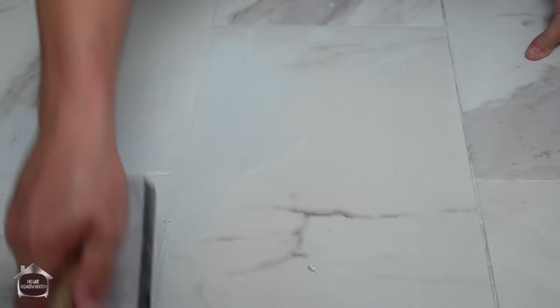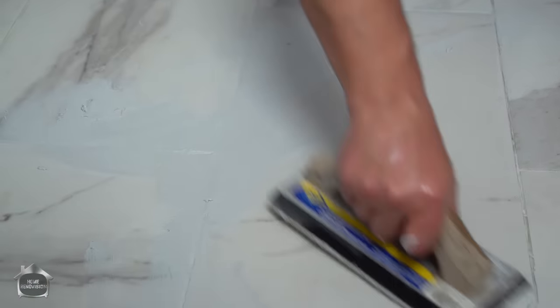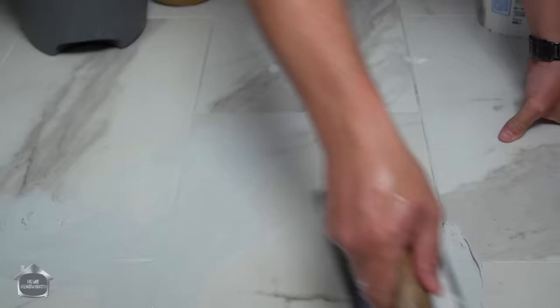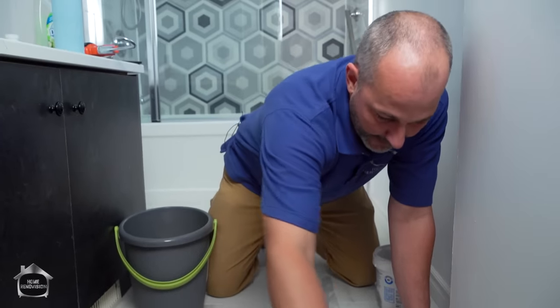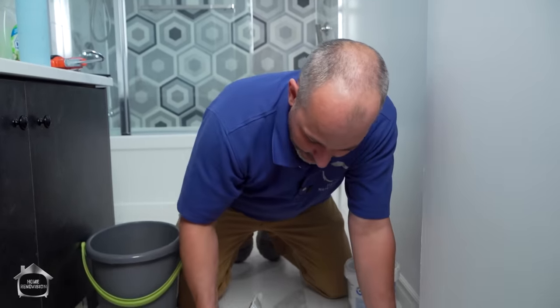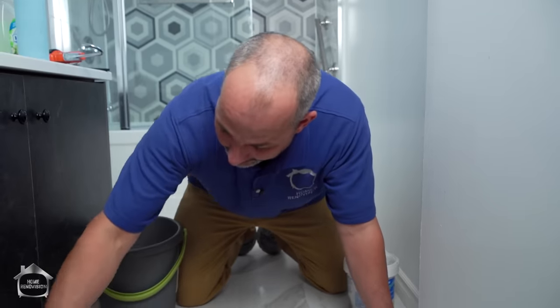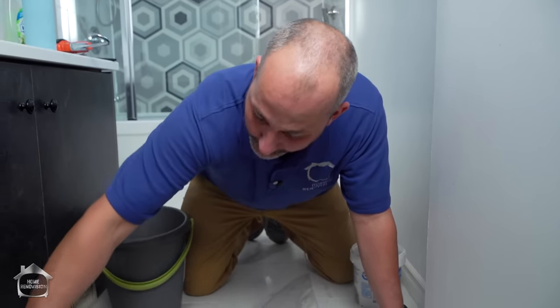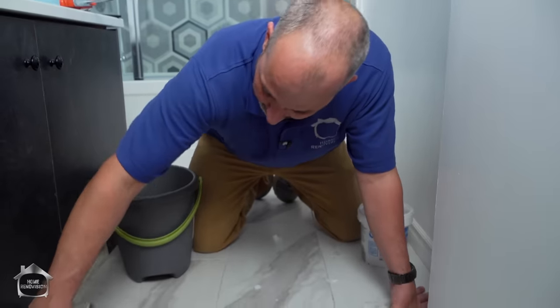This works amazing if you have flexion in the floors. It's also a really great grout for shower floors because epoxy can be part of the waterproofing system — not too many people talk about that. If you have mosaic tile on your shower floor and you use an epoxy grout, you just made your floor waterproof. It can create solutions to a lot of problems and eliminate them from ever even starting.